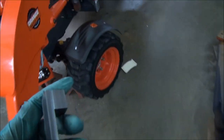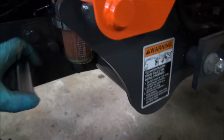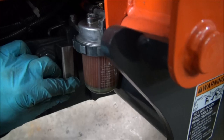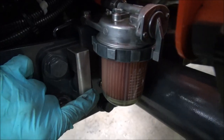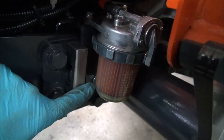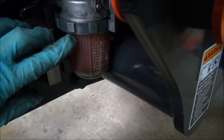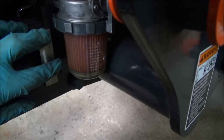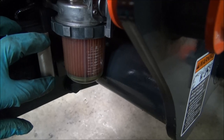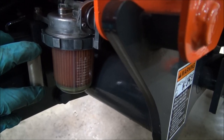Let's go over to the tractor again. As you can see, it will go like that — you can see where it fits down around the bolt. It's hard to hold the camera and do it at the same time. What I've got to do is have it where the bolt can come down and the screw will clear there. So I'm going to drill and tap two quarter-inch holes here, and that's where the guard will bolt to.